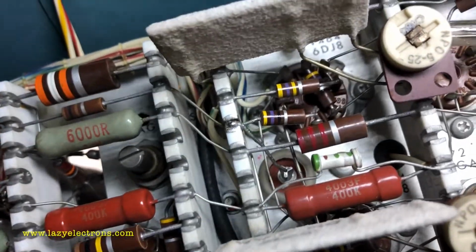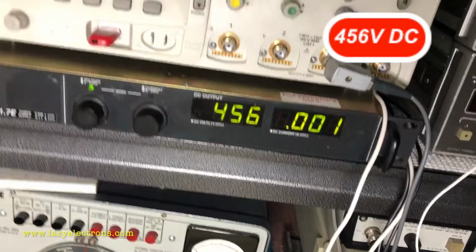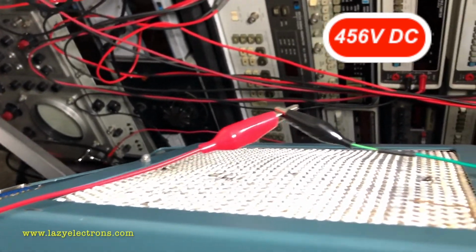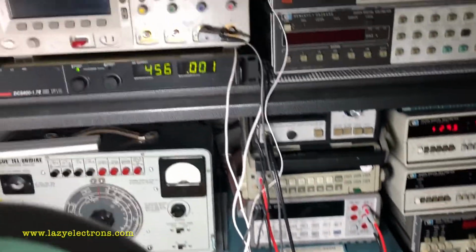And this is how you should not, I repeat, you should not reform your capacitor. That's the switch mode power supply which I'm using for reforming power. It comes out, goes into a highly secure current limiting resistor, which is properly mounted and installed and secured, and that drives through a potentially well insulated cable connection flying through this and into the capacitor being reformed right here, and the ground return goes all the way through another secured connector back through very insulated cable lines into the meter which is monitoring the leakage current and all the way back through very well organized cabling into the power supply. So that is how you should not reform your capacitor.